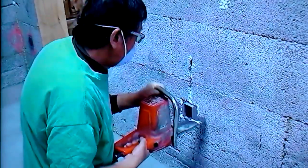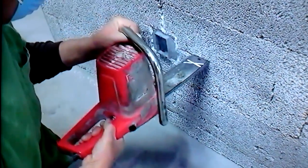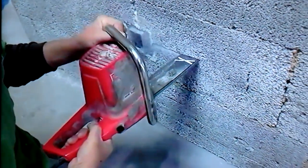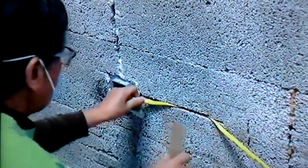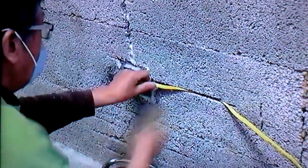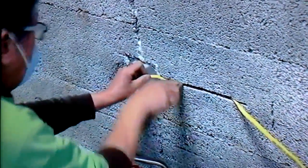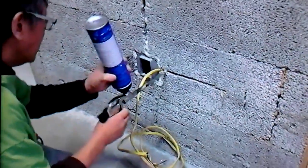There's the pump pumping the mud up. After it's grouted, you take a chainsaw and just hog out where your wires go. The skin is two and a quarter inches thick, and by going all the way to the back you're more than the inch and a quarter required by the building department. This is a demonstration of how easy it is to route out for the electrical. Then just take your conduit, push it to the back of the cell — that's the homeowner Eddie demonstrating. Once it's back in the cavity, put a little spot of glue on it to hold it where you want it.